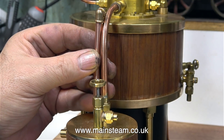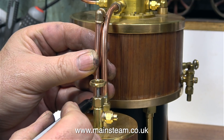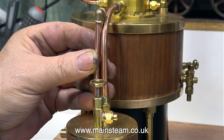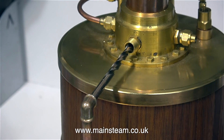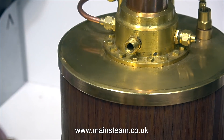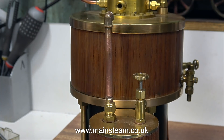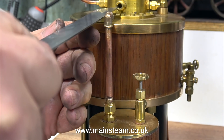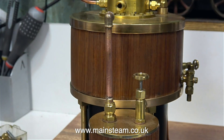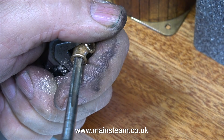That's one cast elbow in position. All I need to do now is mark the length of the pipe and silver solder it into a union cone, not forgetting to put the nut on first. How did I align the elbow with the exhaust inlet? I used a twist drill like this. The camera angle actually makes it look wrong, but it's not — everything is perfectly in line, and you will see that once I assemble the piping system very shortly.